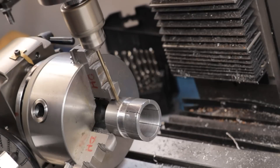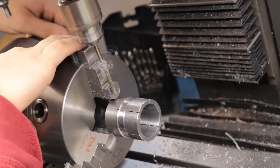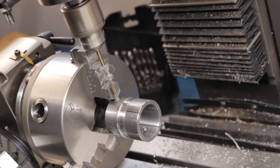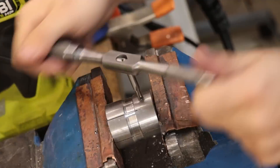Finally I'll get it back in the dividing head and get three holes drilled and tapped for some screws. I think I might have been better off doing four holes to work it like a four-jaw chuck, but three has worked just fine for now — if it doesn't work in the future I can always add some extra holes.